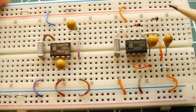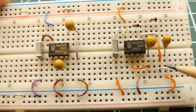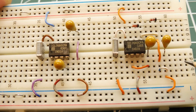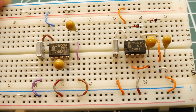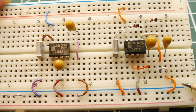This circuit here is similar to the previous one, but I've added two more diodes — this is a voltage doubler circuit. So 5 volts into this circuit will get 10 volts out. I use this for driving MOSFETs. If you want to switch a MOSFET using an Arduino Nano with 5 volts output, you would use a logic voltage MOSFET. But if you don't have a logic voltage MOSFET, you'll have to drive it with 10 volts to drive the gate properly.